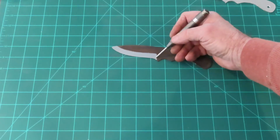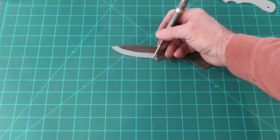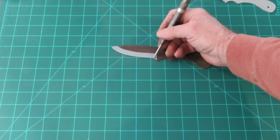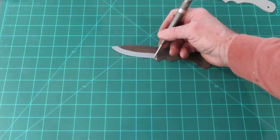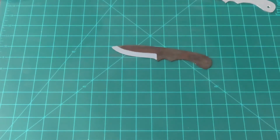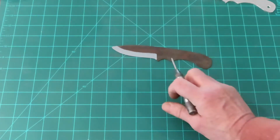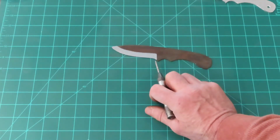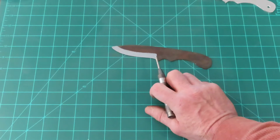It's a semicircle, which makes it nice for sharpening. You have a definitive line that you go to instead of trying to ride up on the plunge cut. So I'll put that in, and I'll put these two in. We're going to wrap this blade in tape, and there's a couple little tricks here. Now this is hardened steel. I tested it. A file just absolutely skates on it.